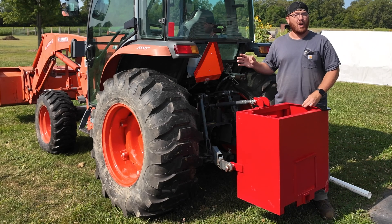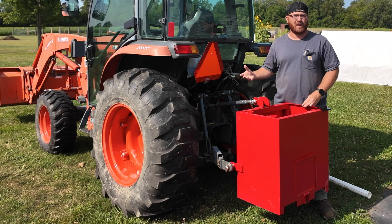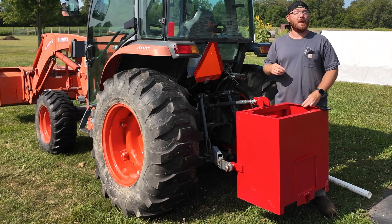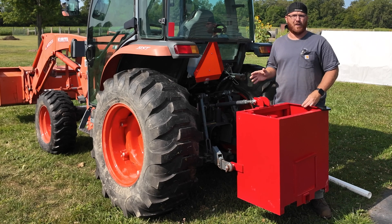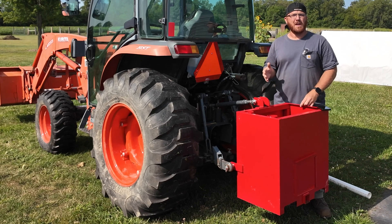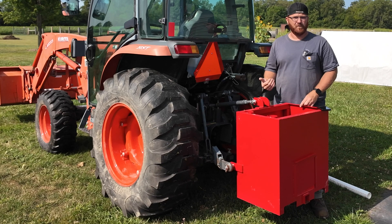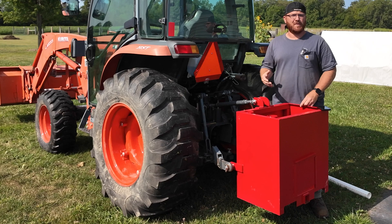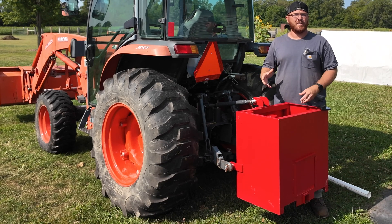To get to that 1,500 pound mark, I already have liquid ballast in the tires. Since I bought this tractor with it already installed, I don't know the exact weight, but I'm guessing it's around 800 to 900 pounds already in the rear ballast. Right now with no ballast weight on the back and just the tires filled, I usually find my tipping point somewhere around 2,000 to 2,100 pounds before I start lifting tires off the ground. When I bring home pallets full of feed at 2,000 to 2,400 pounds, it makes for an extremely sketchy situation.